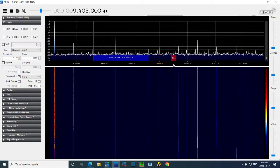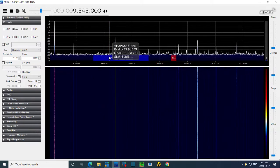If the local oscillator is at 10, and the local oscillator runs above the target frequency normally, then we would expect this radio to respond to a signal at 455 kilohertz less than 10. So that'd be 9545. That's way down here. It's somewhere in here, right? Does that make sense? Did I do that right?